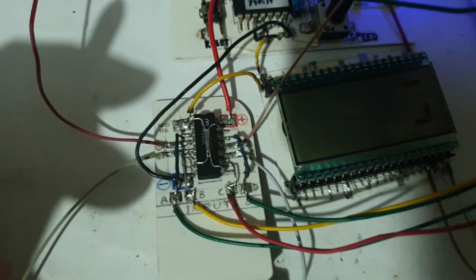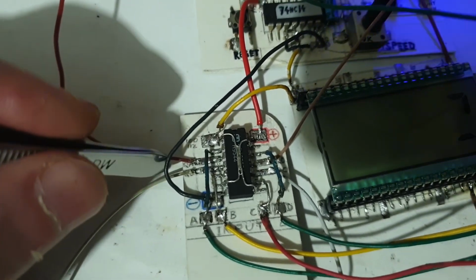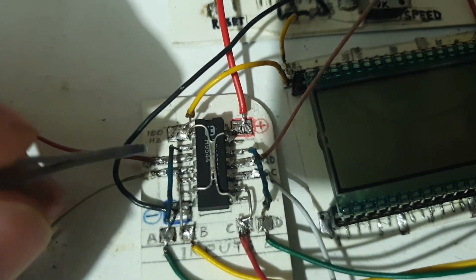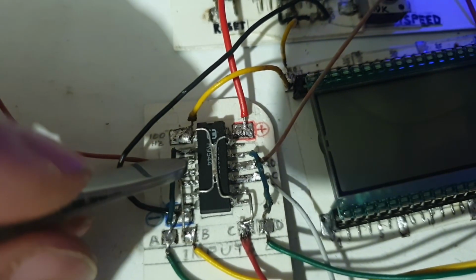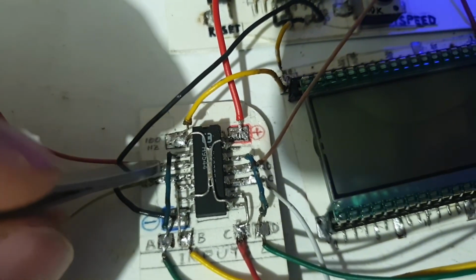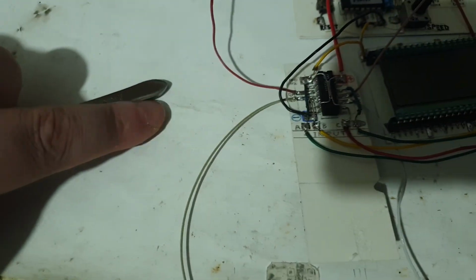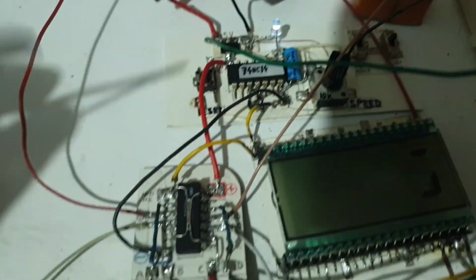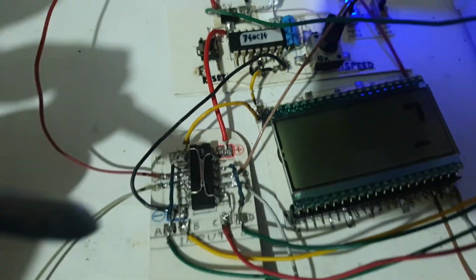And it turned out, when I soldered these output wires, I believe the outputs were the problem, or also the inputs. Probably the outputs. When I soldered these output wires here, it snapped off, it springed out from the leg of the chip. It springed out from the pad. So instead of staying on the pad, this is the leg of the chip, it got like this, you know, a tiny little bit out. And when I pressed it, I could see it move. And I resoldered every pin, but it took me like 1 hour.